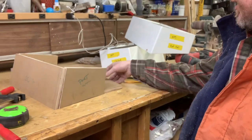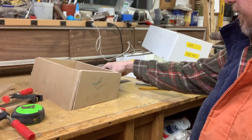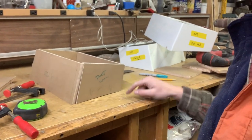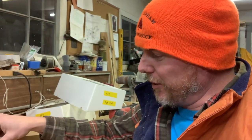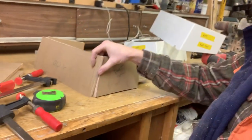I had to do a little bit of trimming because each one of these boxes has a rounded bottom. I had to do a little trimming, and the back pieces have a bevel on them — I did that bevel on the table saw. I was a little off my mark, which made things a little bit taller, but honestly I'm okay with that. I'm just going to sand everything down flat with the Festool. The top does fit and it looks good, but it's 5:16 right now and I'm tired, so I'm going to head home and we'll pick this back up tomorrow.